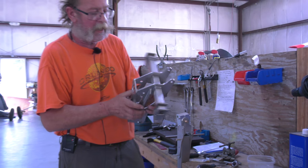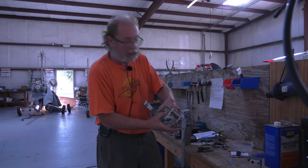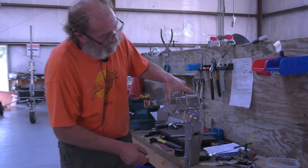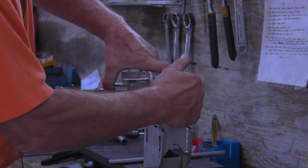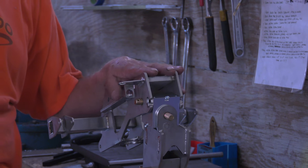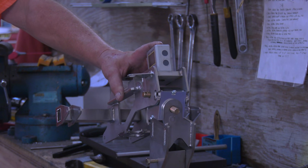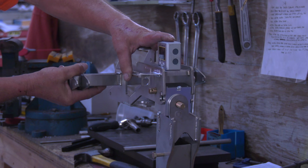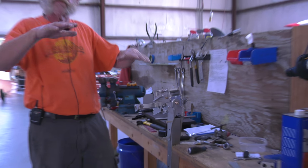Now I take the rotor head itself. It has the pivoting point for the pitch here — that's another half-inch bolt — and here is where our stop pin grabs. I measure our desired angle: it's 20 degrees backwards and 1 degree forward. Putting my block on, it tells me 20.1 degrees backwards — ideal. And 0.8 to 0.9 forward — good. We are pretty well within range.